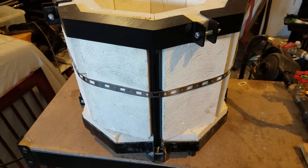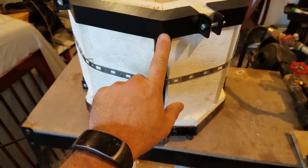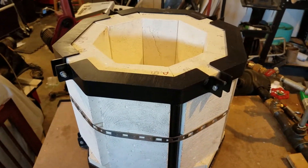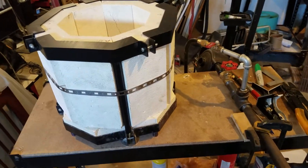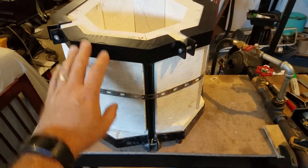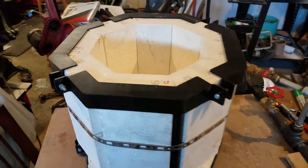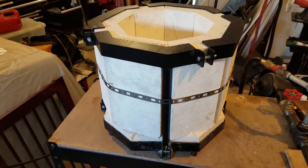In order to convert this into a forge, I'm going to put a leg right here and two legs down here on the bottom — just short, maybe an inch and a half to two inches long — and that way it'll allow me to roll the whole thing over onto its side. The lid is going to have a similar angle stock frame that keeps it in compression, and then we'll put some hinges on the side. That'll allow the lid to be hinged in the foundry mode or be a swinging door in the forge mode.